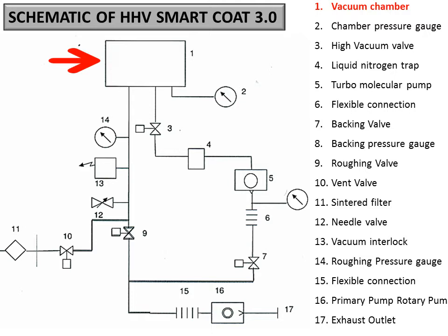And if you are using a liquid nitrogen trap on the turbo pump, you can go even below 1E-7, at which deposition of titanium-gold, nickel-gold, aluminium, titanium-aluminium and aluminium-gold, whatever you want to do, will stick properly to the samples. So this is the good thing about this system, that you can achieve pressure below 1E-7 as well. Right now I'm going to explain one by one.